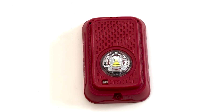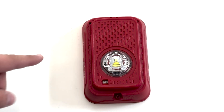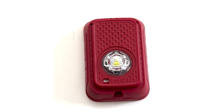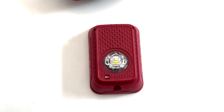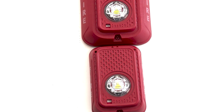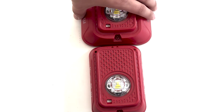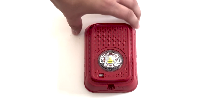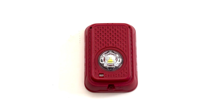The SGR LED is nearly identical to the P2R LED, with two major differences. Most obvious is the lack of a horn, as this is only a strobe model. This device is sized for a single-gang mounting plate rather than a double-gang, which is great for new installs looking to minimize their footprint, though many older installs may have a double-gang box. It's worth noting that horns and strobes both come in either a single or double-gang variant.